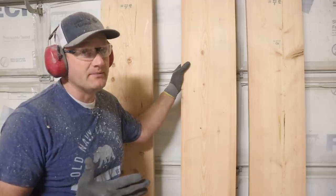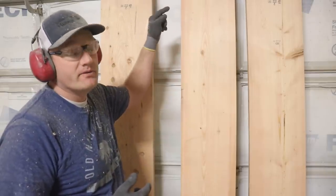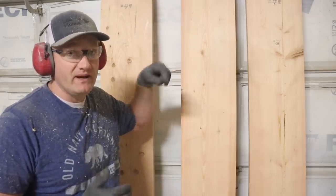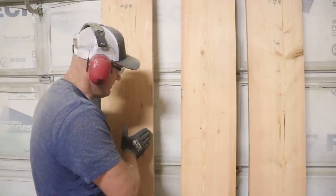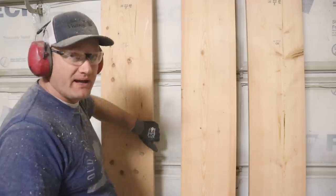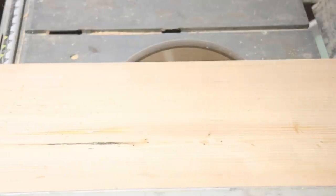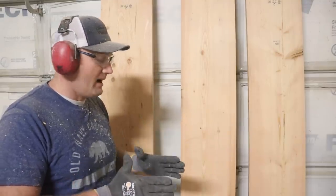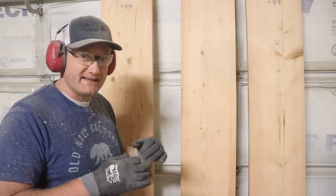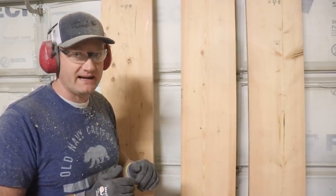I'm going to start out with the tabletop. It's going to consist of three 2x12x8 foot long planks. I'm not going to trim them at the edge — they're all a true 8 feet and we want an 8 foot table. When you get your wood from the hardware store, it's going to be rounded because they plane it to get it down to a uniform size. I have ripped along the edge down the side so I have a nice straight edge to glue up, and that'll also help keep from having big creases and cracks. Since this is going to be a work table, we don't want a lot of gunk down in the cracks.